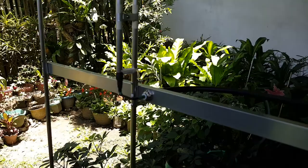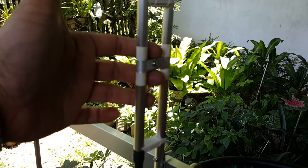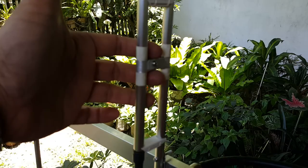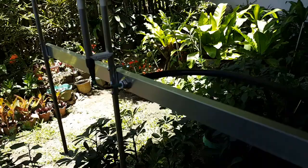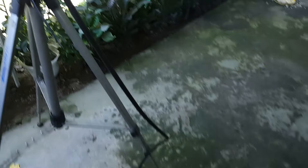We have a gamma match Yagi. This is the SO239 feed point. We have the tuning stub, which is initially positioned to the desired operating frequency. We have the plastic spacers — you just need to secure the plastic spacers with a cable tie, which is included in the package. This is now connected to my antenna analyzer.